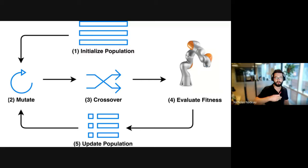And each time the evaluate fitness step we saw before is run, the actual robot with the Java controller was called from the SciPy optimization function through gRPC to run a session with a given vector of motion parameters, let's call it. And it responds to the Python data stack with a session result filled with the force sensor data that is then converted to a single float measure, fitness or quality. Basically, let's look for bounce-free motion. And so, hardware in the loop for standard data science.